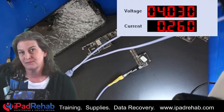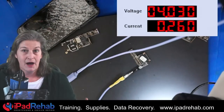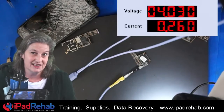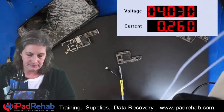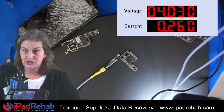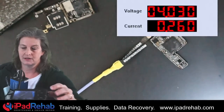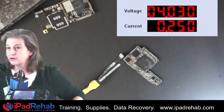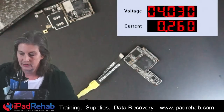So we're not really sure what actual power rail is allowing electricity to go to ground and causing that 0.260 amp leak. So we're going to see if we can get a clue where that might be by using the thermal camera. Let's flip this around and make it so that you guys can see the thermal camera. I switched out my blue mat for this black cutting board — let's zoom in a little bit. Maybe that'll have a bit of a cleaner look. All right, we're going to find my phone and use the thermal camera to see if we can figure out what line might be short.